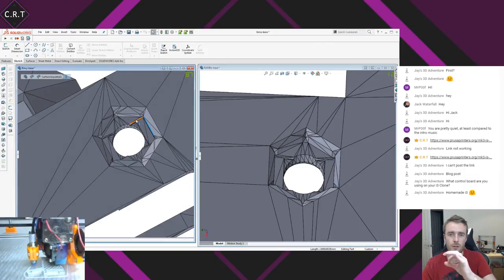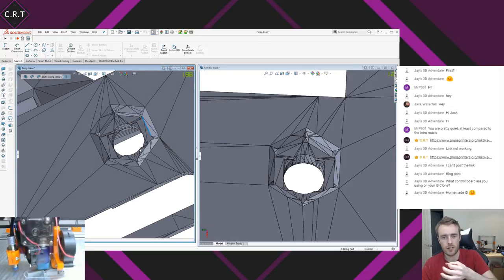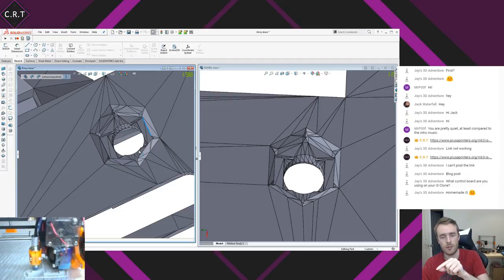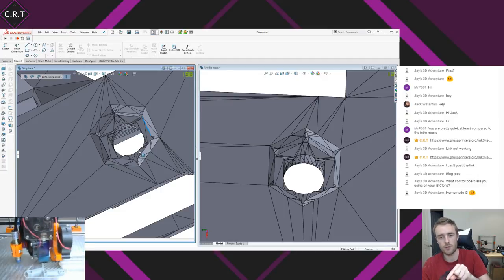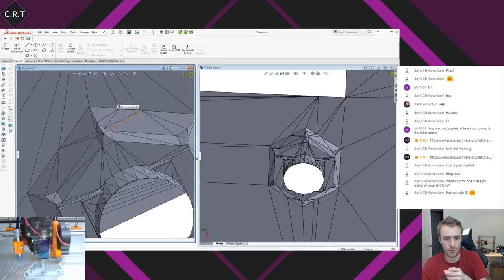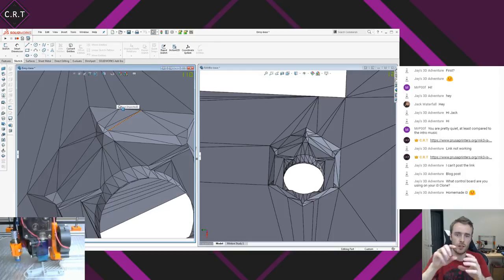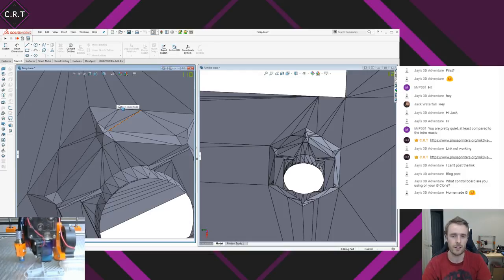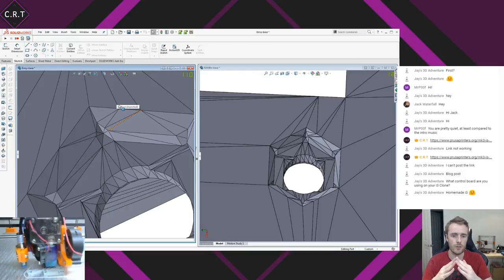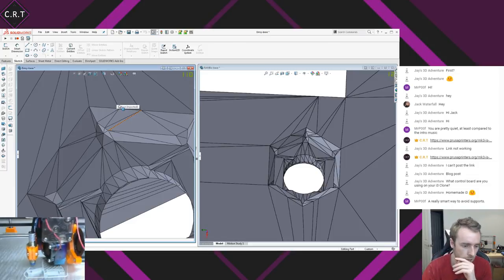So typically, because of the ramp up in speed and changes in motion, as you get to corners, you typically over extrude slightly. So by having these little cutouts in the corner, you get the head to move towards the corner and then around, and it gives a larger area for that plastic to be distributed over. And although it might still over distribute the plastic, it won't put it in the corner.